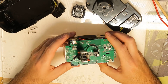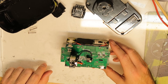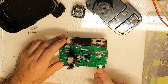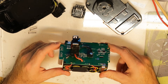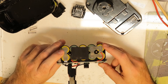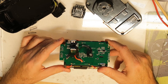Another thing you can see: there is a dual MOSFET that is probably transferring the power output, and there is a big heatsink in order to supply high current out - that's nice. There is also marking on the PCB for each voltage, so it's very easy to understand how to connect this back. And these of course are the balancing wires.